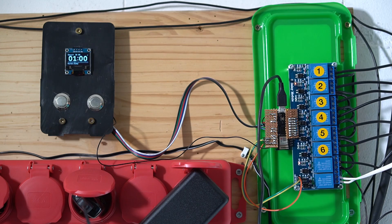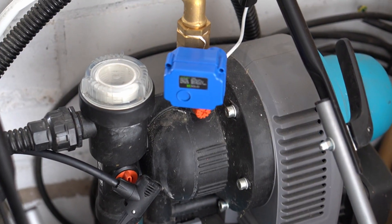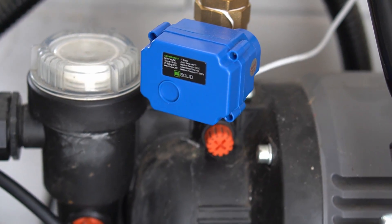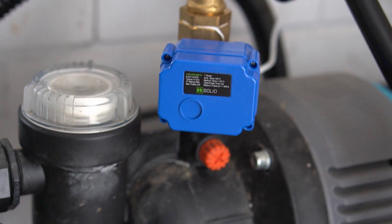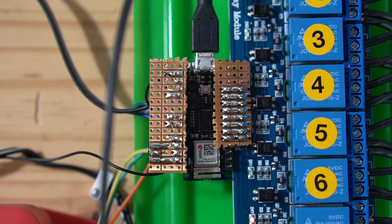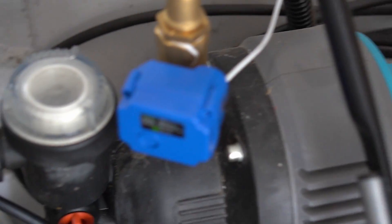So I need an Arduino to control a bunch of valves. I start with a normally closed ball valve. This is only there as a safety measure, as it also closes the second tap which my son learned to open when he was one year old. As soon as I enable either the sprinkler system or just water access on the Arduino, this valve opens with a timer. Once that timer runs out, or if the system loses power, the valve closes and my son cannot flood the garden.